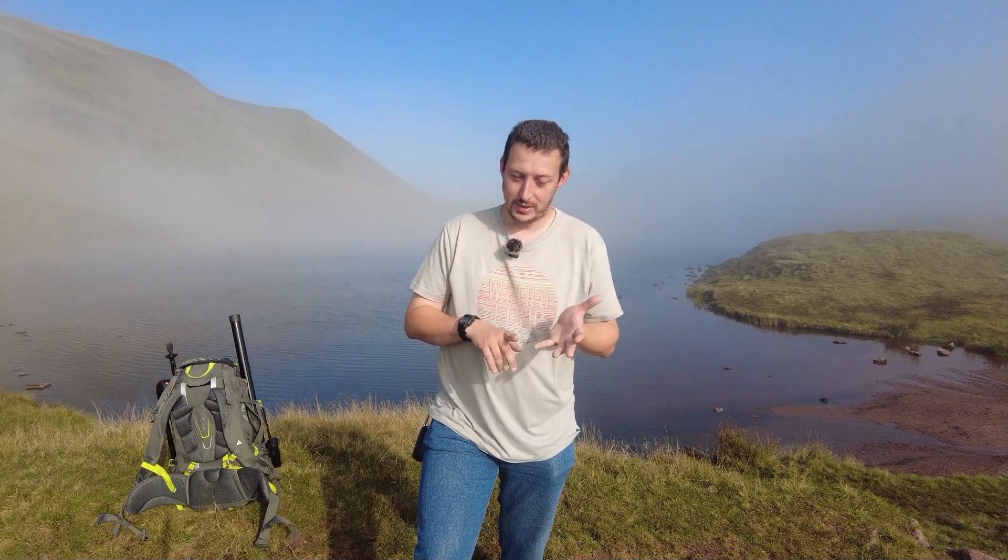What I want to talk about today is antennas. I previously put out a video about the Slidewinder coil and military whip, asking if that's the best antenna for SOTA, and I said it was a good contender. Today I want to show you another option - this is a half-wave inverted-L. The Slidewinder and mil-whip is ultra-lightweight, very quick to set up, and doesn't take up a lot of space - so if you're on a summit with little space or lots of other hikers, that could be the answer. But on the flip side it is a compromise. The inverted-L is much less of a compromise - it's a full-size antenna so you get better performance, but it's possibly not the best option on a busy SOTA summit.